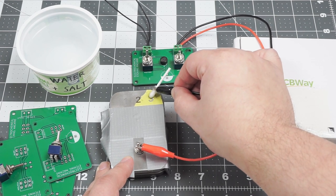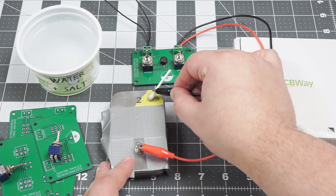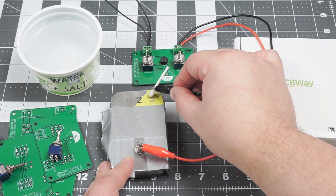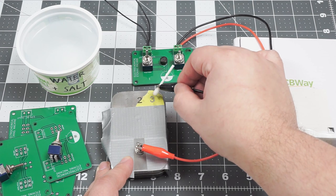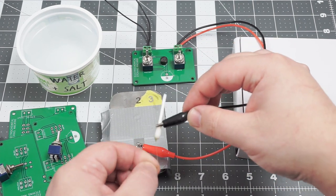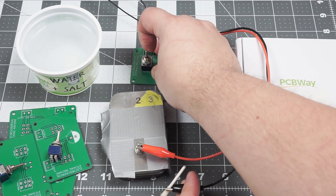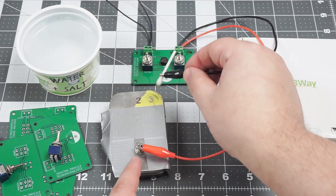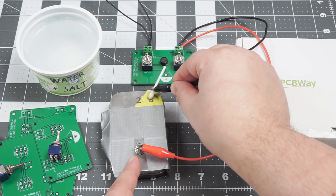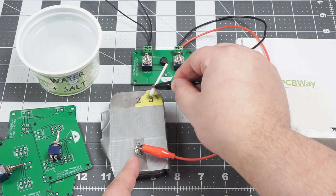Dip the Q-tip in the electrolyte solution every now and then. Experiment with scrap metal to find out how long the duration should be and how many times this needs to be repeated for perfect results. After etching with DC, switch the mark/etch switch down, making the output AC. Repeat the dabbing process until the desired marking intensity has been reached. Again, experiment with scrap metal first to see how quickly things happen with your setup.